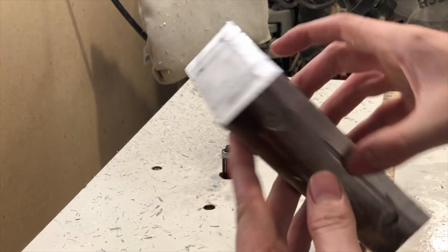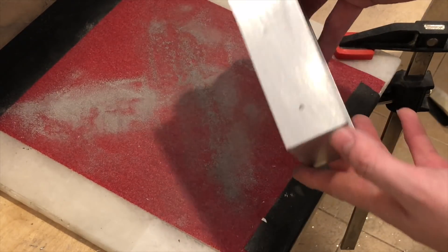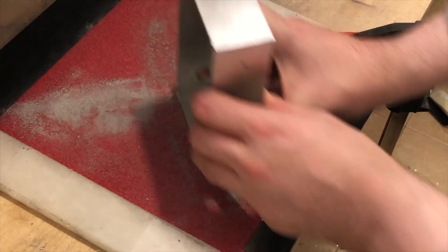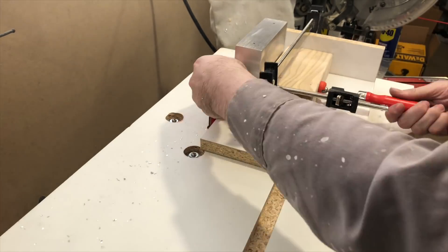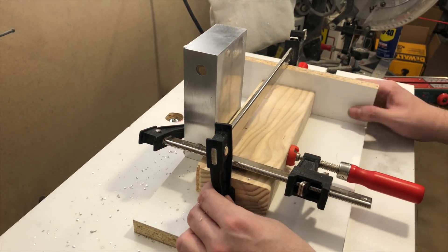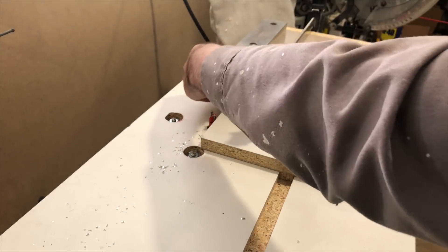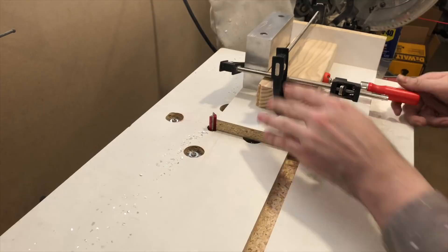The router doesn't leave a good finish though, but a few minutes with some 100 grit sandpaper makes the sides perfectly smooth. Later I'll bring it to a nice high polish, but for now the surface finish is acceptable. The last thing I need to do on the router table is clean up the back of the box. To do this, I created a simple jig that the box can be clamped to, and then run across a standard half inch bit. This process is much simpler and easier than using my mill.